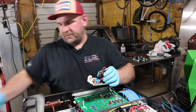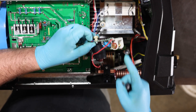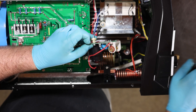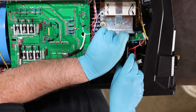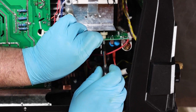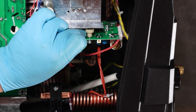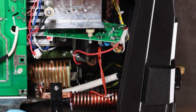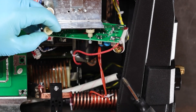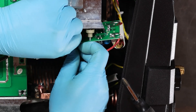Let's go ahead and put this new board back in. We've got our spacer and our screw through the board to start, with our points facing towards the front of the machine. Now we can go ahead and start reinserting this board. You want to go to this front hole of this mount, get your first screw started, grab your next spacer. This is where it's going to be a little tricky for hand position and getting everything to line up, so just take your time.